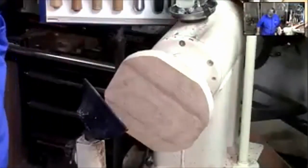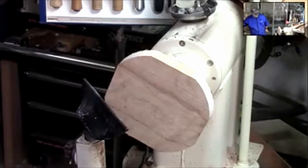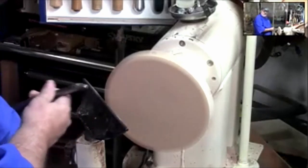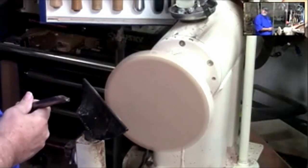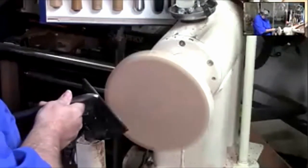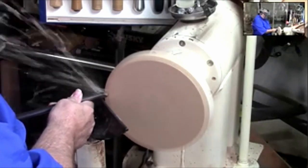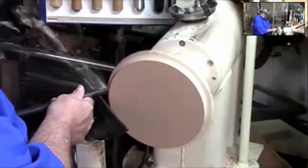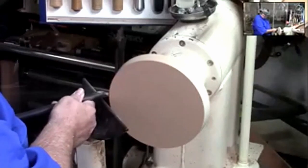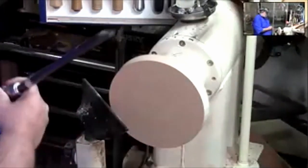Yeah, Captain, when I first started turning, I went to a store here in Houston, and I bought a carbide tool, and I knew nothing about it. It had a hunter type cutter on the end of it. And the folks there at the store told me, lay it flat and push it straight in. I had wood and tools flying all over. That's a good point, Dean. And the other is, folks, if you wonder how your tools cut, run your lathe down to 1 RPM, just one, and or have somebody turn it for you and watch the cutter cut.